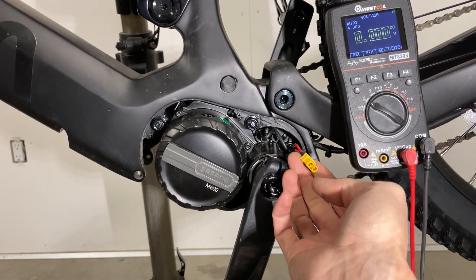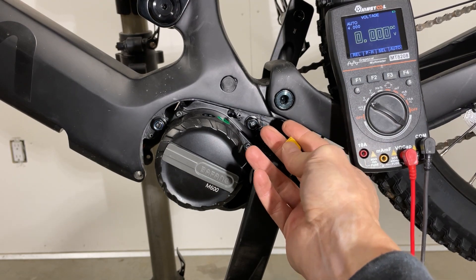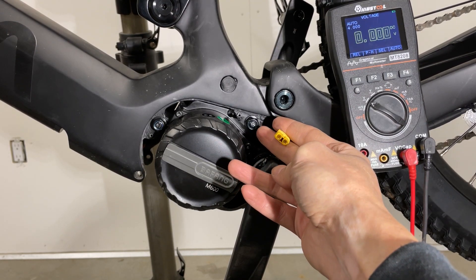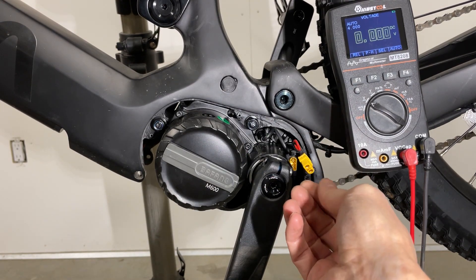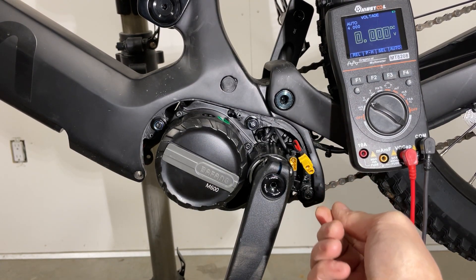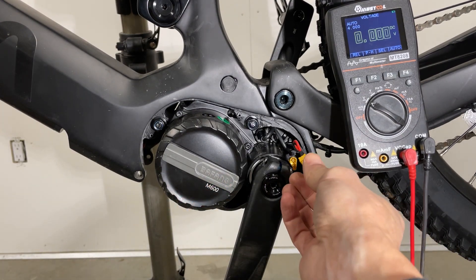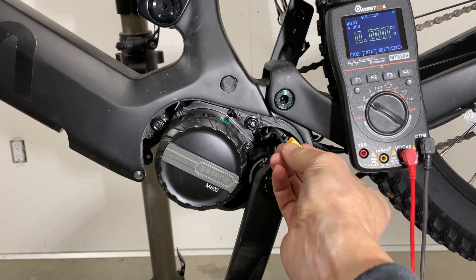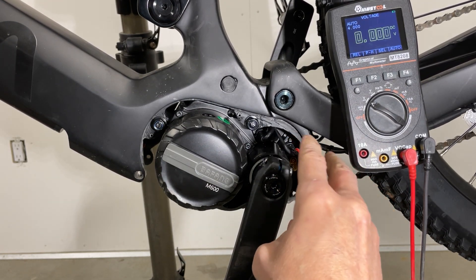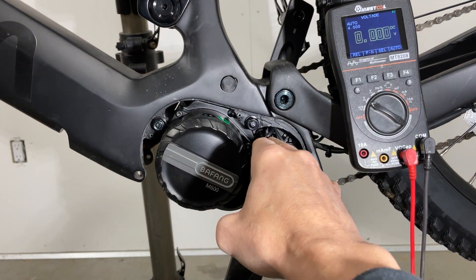One thing you can do is wire a light bulb directly to the XT60. Just make sure you don't short out anything — best would be to use an XT60 male with two wires sticking out and then touch the light bulb. But just be careful not to short out anything. If you don't want to do that, it's fine — just move on to the main connections.